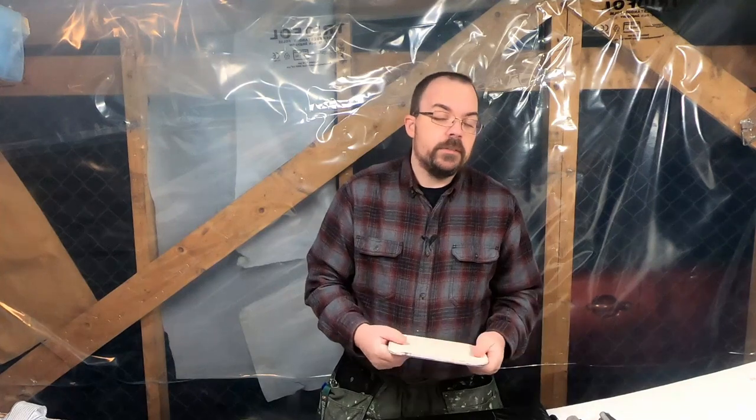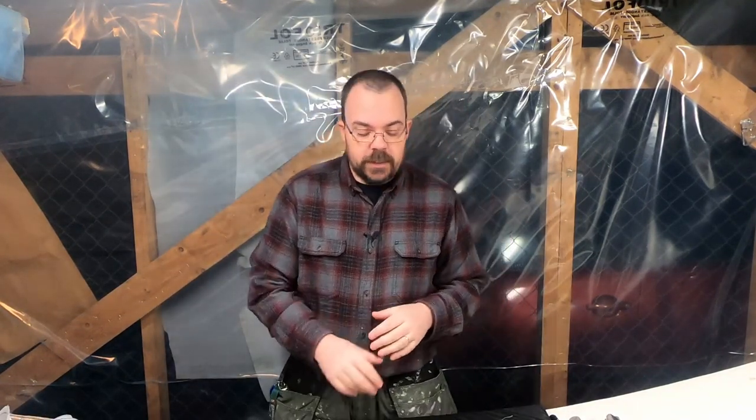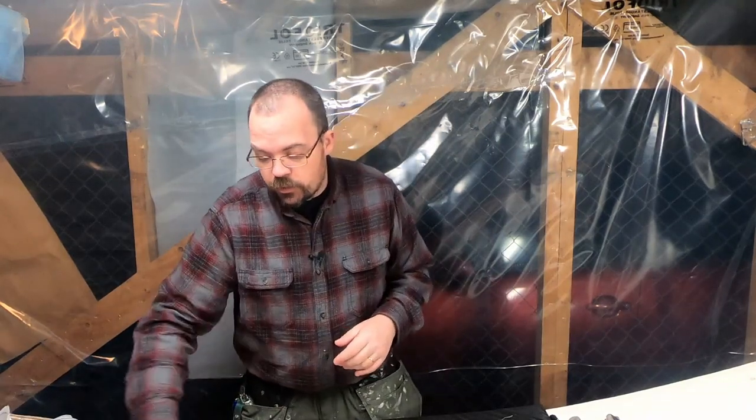And when the strips are set down, I'm gonna put 2 layers on top and let that cure. Then next time I come back here in a day or two, I'm gonna put 2 layers on the other side. And when that's done, I'm gonna cover everything with a layer of gel coat that I later on can sand down to a smooth surface. But let's first mix up some polyester resin and saturate these surfaces.